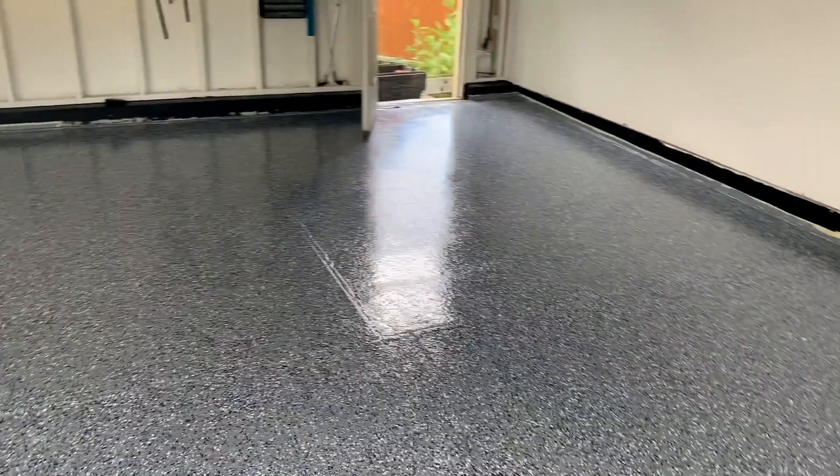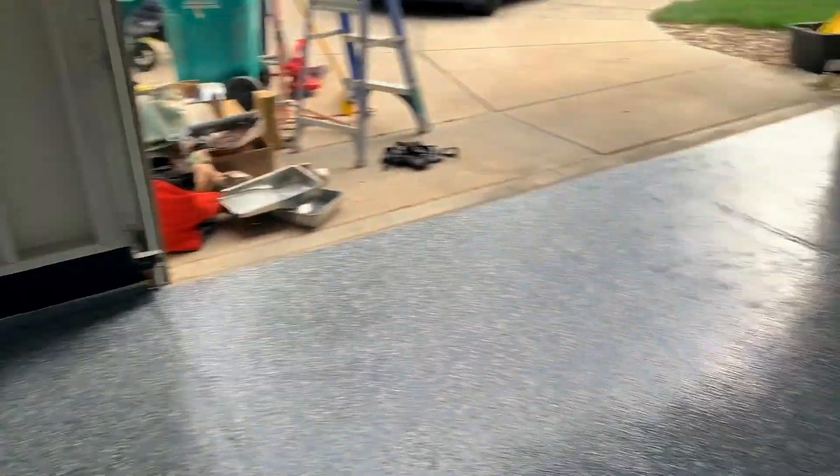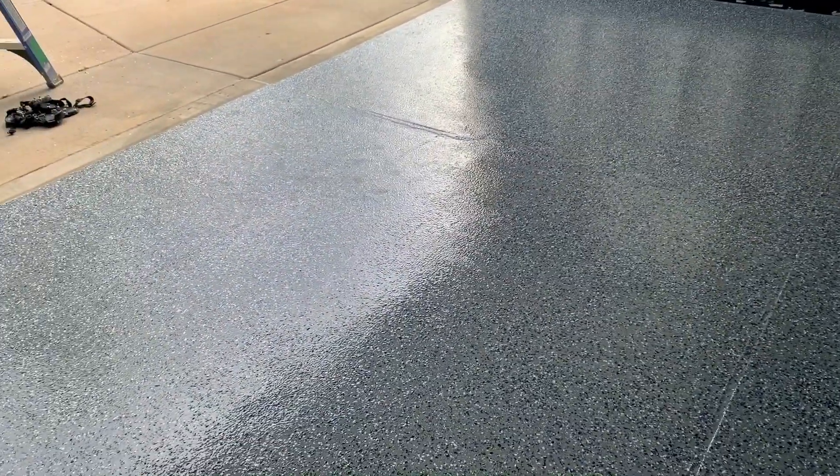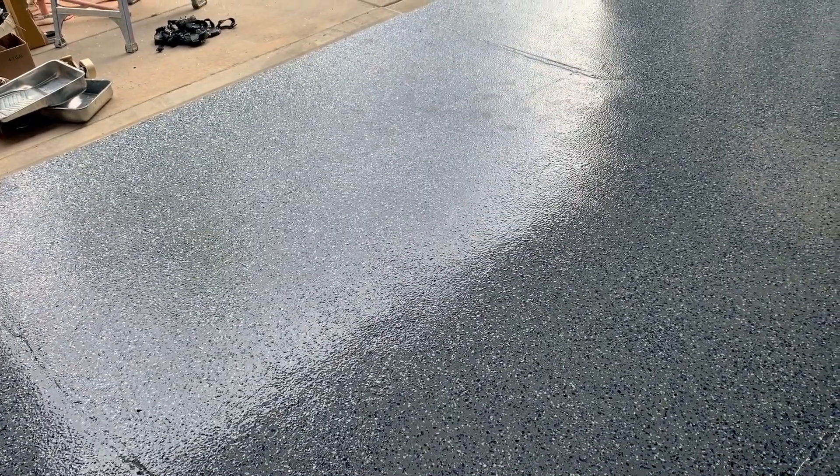I'm really happy with the result. I had to repaint my foundation because pulling off the tape also pulled off that one-part epoxy — not impressed with that product. But the actual epoxy and polyurethane I put down is not coming up. A couple of drops outside the garage were incredibly hard to clean up — very impressed with this stuff. You can still see some grooves when the light hits just right, but in normal lighting it looks like one consistent smooth finished floor. Thanks for watching — put questions in the comments and I'll see you next time.